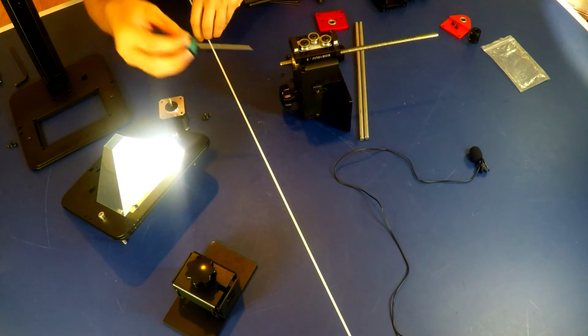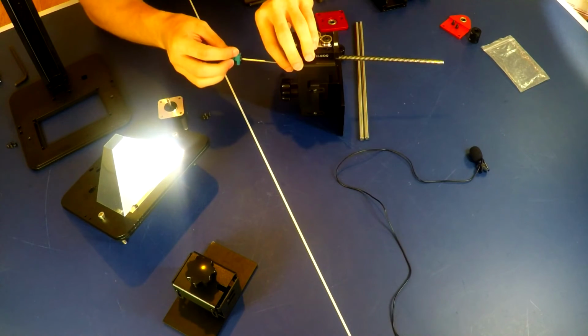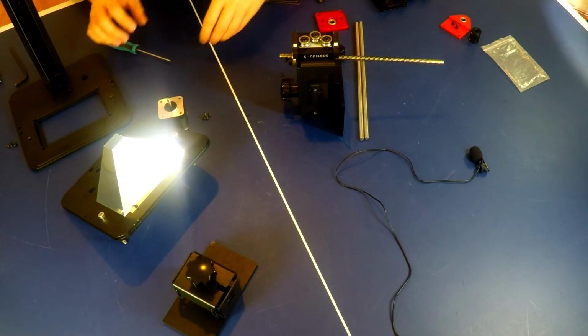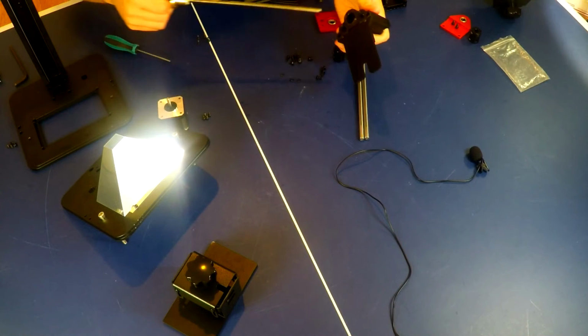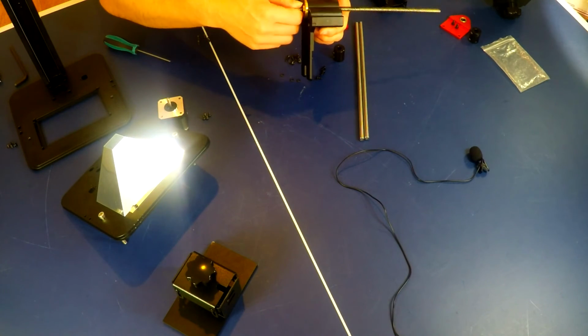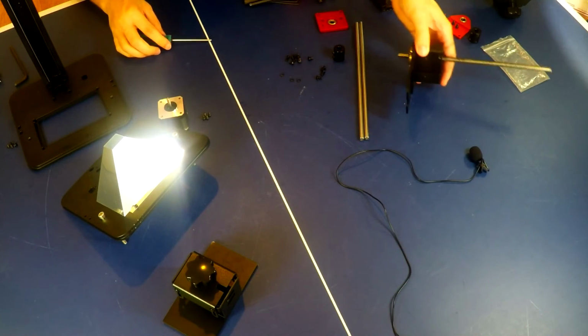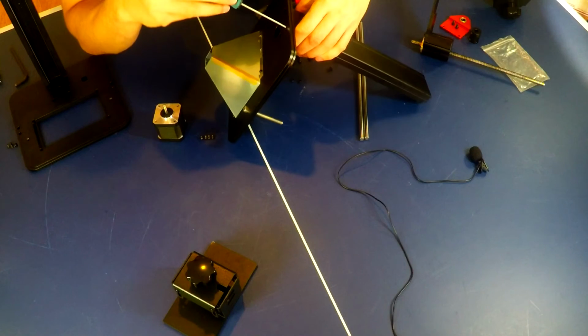The lead screw and the nut are held on by 4 screws at the top. As soon as we've got all the little nuts off, we're going to put them aside safely and immediately transplant the lead screw and the nut through to the new carriage. It goes from the side with the largest section. We immediately put back in the 4 nuts and we do them up as tight as we can so this part is completely finished and ready to move on.